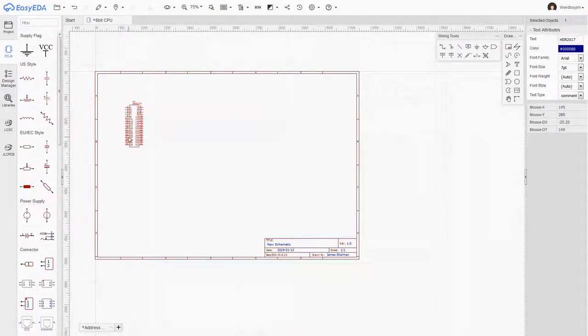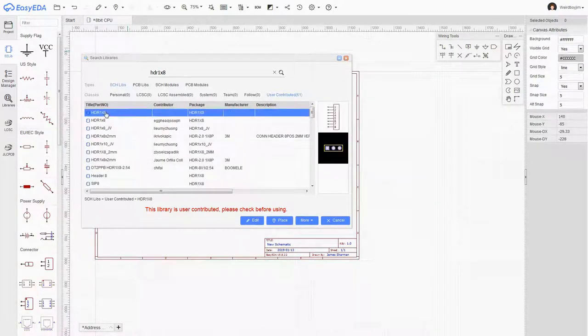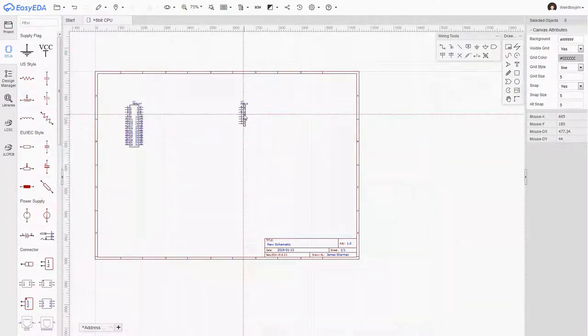And then, so these are basically all the main lines that are common. And while I'm working on the CPU, I'm thinking I can make an easy backplane that will connect all of these up together, which means I've only got the control lines that I have to worry about doing separate hookups for. It doesn't make a great deal of difference once we switch to a final backplane PCB, but that's a little way off at the moment. Okay, so then I'm going to use one of these little 8-pin headers for connecting the control signals.